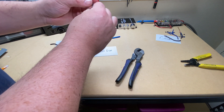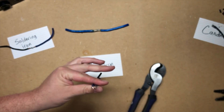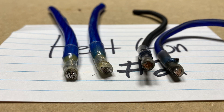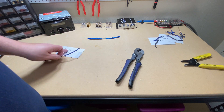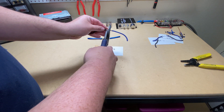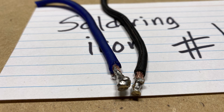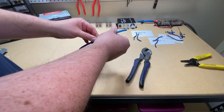The heat gun is looking a little better, but it still didn't get full penetration of the solder. Let's cut open the regular solder for comparison. If you can look past my horrendous soldering skills, you'll see we got much, much better penetration on the wire than any other method tested so far. I'm leaning heavily toward soldering by hand versus these connectors. Let's try the 10 gauge one and see if we had any better luck.